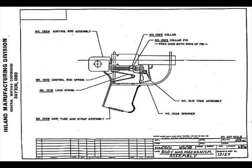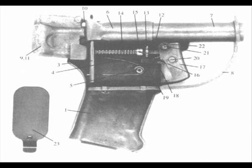With the exception of the 4-inch smoothbore, seamless steel tubing barrel, and die-cast percussion mechanism, the gun is constructed throughout of sheet stampings and a few small steel pins and coil springs. The various parts are held together by a combination of folded seams, rivets, spot, and acetylene welds.